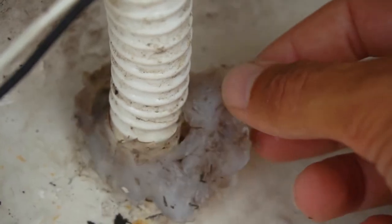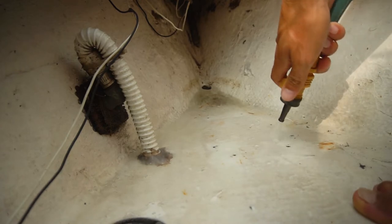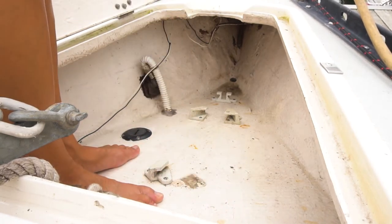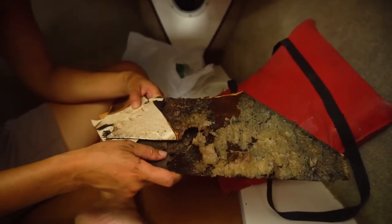Water is coming in from everywhere - it's terrible. The vent caulking is lifting up, the marine silicone used here isn't holding to the fiberglass. Our anchor locker drain hole seems to be where most of the problem is coming from - the drain isn't completely sealed, there's some bare wood around that hole that needs sealing and it's a little soft. There's basically no silicone. We're going to start attacking the anchor locker because it's really moldy and I've been super stuffy and sneezing - and it's right above our bed.